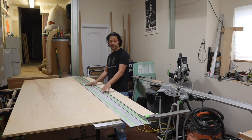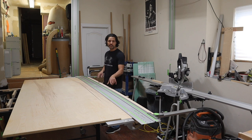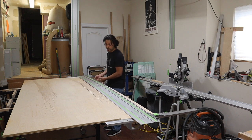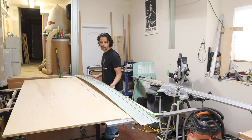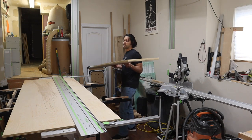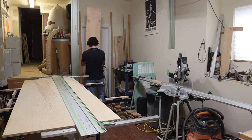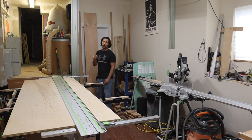After that cut, I just slide the piece over. I know I can get three sides out of this one piece. We're going to square everything up later using the MFT with the fences to make sure everything is cut exactly to size and is square. With the parallel guides, you just move them down, pull the piece out, and stack it on the back or stand it up and get it out of the way completely. Label it — these were 336 — just so I know to come back later. Those are going to be parts of my sides.